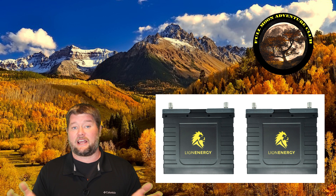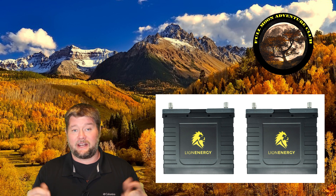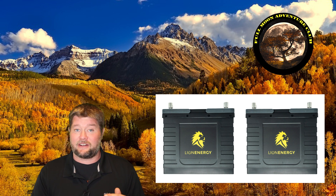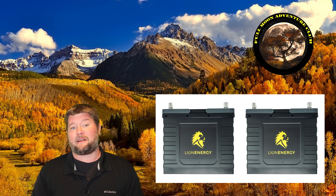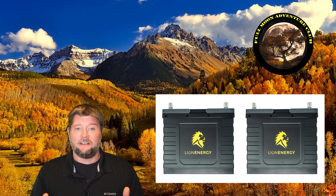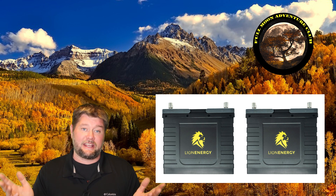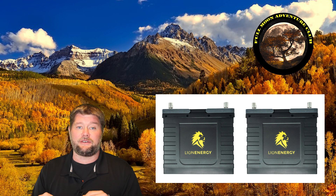With all that stuff — all those lights, the fan, the stereo, a little TV — 41 hours and 18 minutes is incredibly impressive. These batteries will take 150 amps of discharge. I did a video where I actually run an air conditioner off of these — it lasted about three hours with a 15,000 BTU RV air conditioner, which is huge. You can charge them up to 100 amps at a time, which is super fast — you can charge one of these batteries in about an hour, compared to lead acid which takes six or eight hours for bulk, absorption, and float charge. With these, you can just dump power into them and they'll go all the way up.